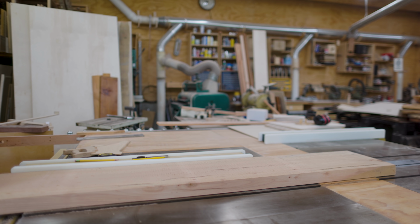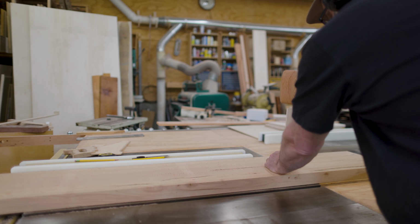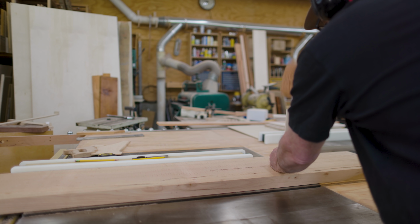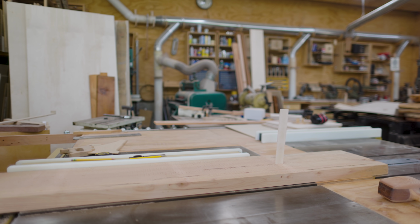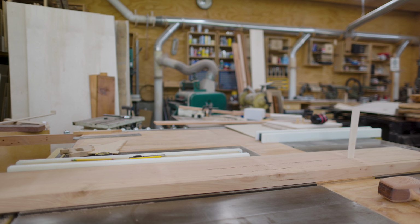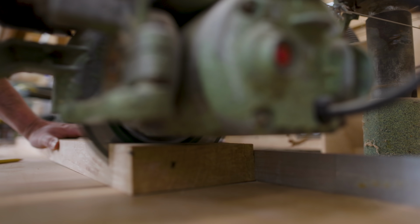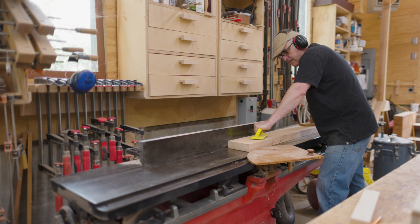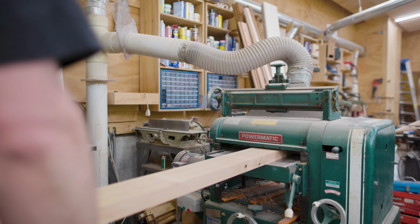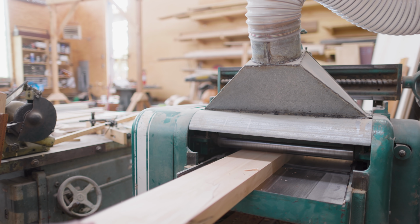It got a little stuck on my throat plate fin as the wood was sort of closing in on the fin. So I used a wedge to open the kerf up. So at this point, I'm slowly cutting this piece down to get to a point where I can cut out the pieces that I need. So I'm shaping the lumber down to what I need.